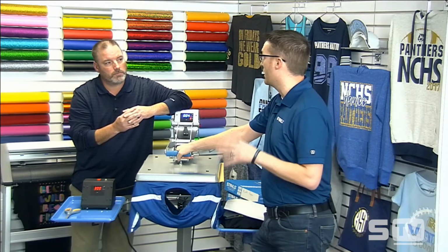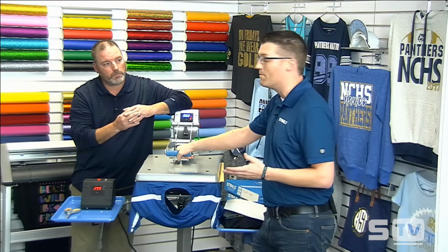Yeah, there's a lot of different products that can be compatible with this. So we found that your low temp adhesive products, and for those of you that watch the morning show, you know Premium Plus applies at 280 degrees. Typically it takes 8 seconds, and it's a warm to a cool peel. On this, with the 200 and 300, we're actually hitting that 260 degree melting point for the adhesive by bringing the heat up from the bottom and giving it that application.